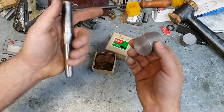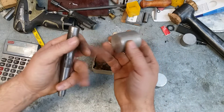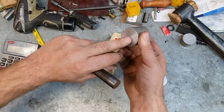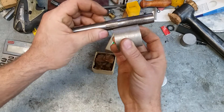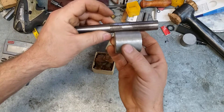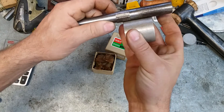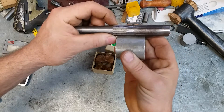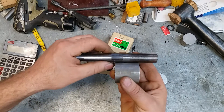What I aim to do is take this three-quarter stock and bore a hole through an aluminum slug — probably a size or two smaller than three-quarters of an inch. I'll measure that very precisely, figure out what size it is, and then turn this shaft to get a press fit from my aluminum onto the steel shaft. When I beat it all together it'll be a beat fit — I'll smear it with some Loctite where it don't come back apart.